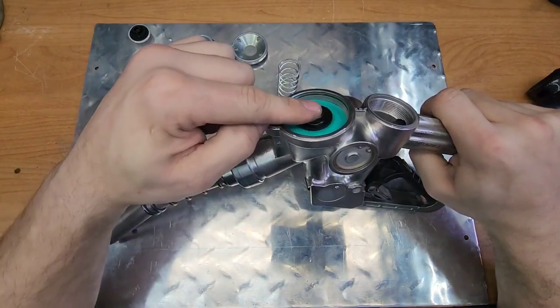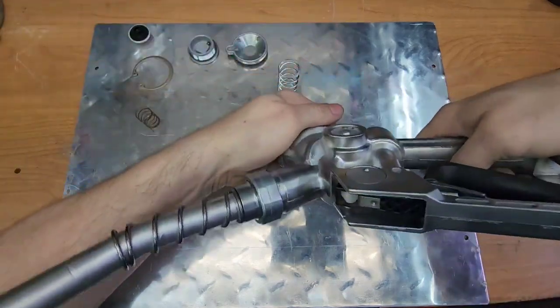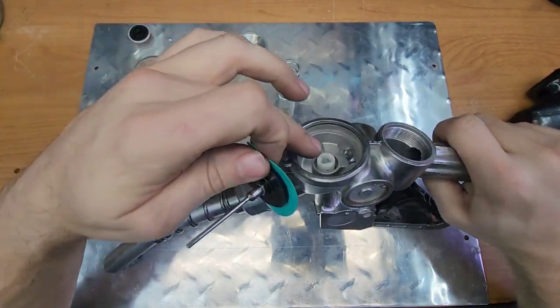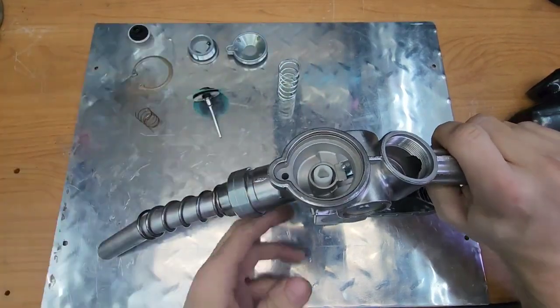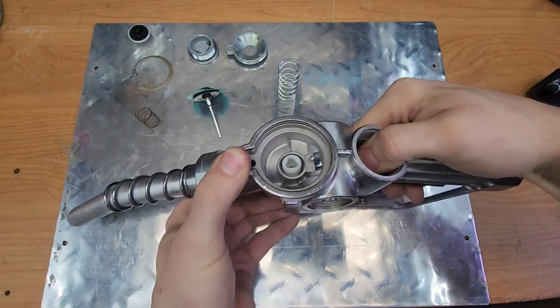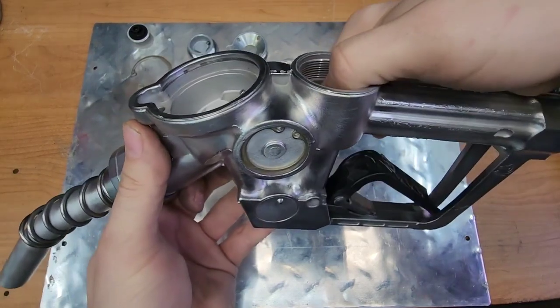What does that vacuum do? It lifts up on this diaphragm. Well, actually, technically, the pressure pushes it up. And when that, again, gets momentarily pushed up by that, it allows those ball bearings to fall into the hole, allowing that to pop down through. So like I said, this is being held up, and you're pumping pressure up through here. Well, the second that those ball bearings pop out, that drops down and allows the handle to release.